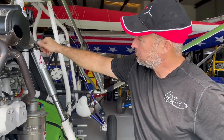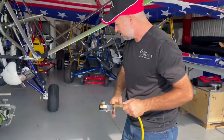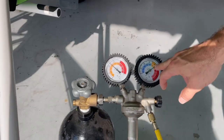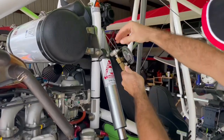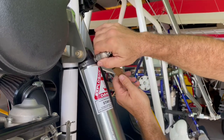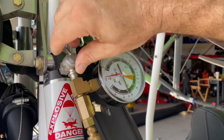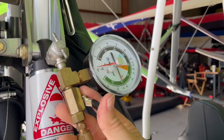When you take off this valve cap, it's a very good idea not to set it on the aircraft — put it on the floor or set it aside. Looking at our gauges, we've got just over 600 psi on this gauge, and we need a little bit more than 600 to get the right reading up at the shock gauge. You may want a wrench, but if you know this trick, once you get snug with your fingers you can just turn the whole valve and that's tight enough. Go ahead and turn this valve, add some more to it — there's our 600 right there.